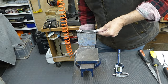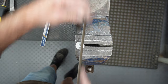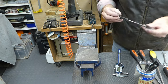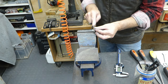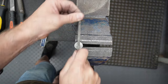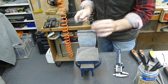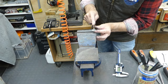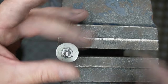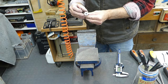Turn it over to the other side. All right, that's all we need - just a notch to sit the wire in. You do need to take all the sharp edges off so it doesn't cut the hose. I'll take it over and give it a buff on my wire wheel because that really smooths everything up, and then we're finished.